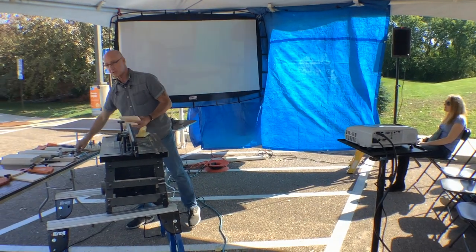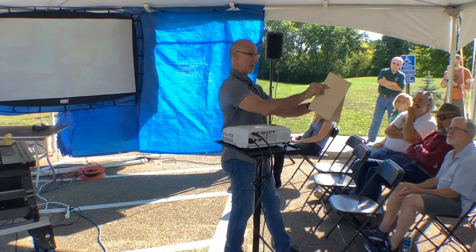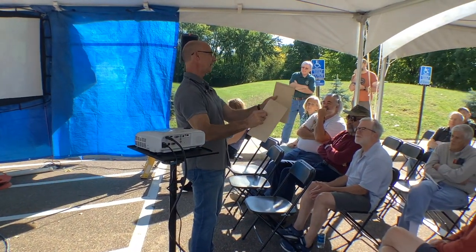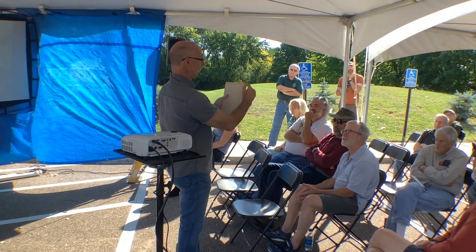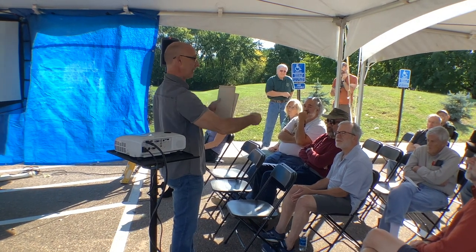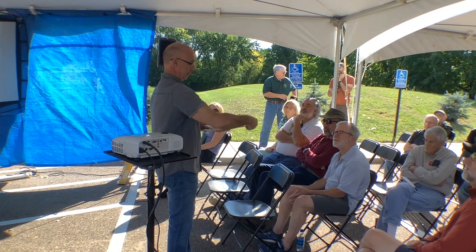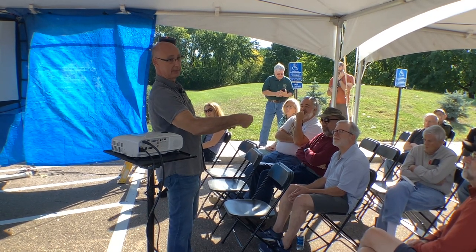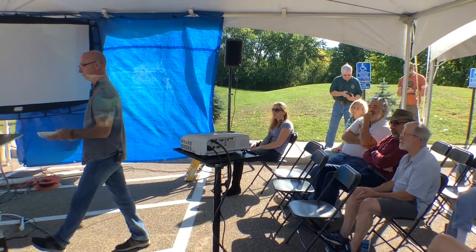The fence location isn't critical. So this will come back down to what we were saying. At the end of the day, if I'm making something that's got to fit in somewhere, I need to know this leave behind and its mate on the other end of the drawer box. But whether it's truly a quarter inch or not, I don't really care that much. So I'm not worried about the fence, but I'm worried about the tongue.